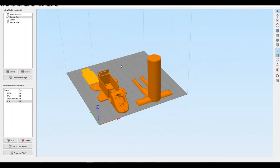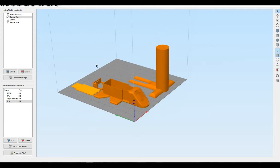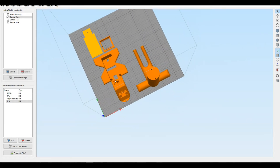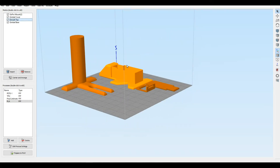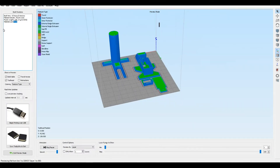In Simplify 3D, the first five millimeters are 100% infill so I have a solid base all the way across with no bending when there's weight on it. The base 2 is also 100% and then I go up to about 30% for the rest of it. I was able to tap these holes, and this is printed on the CR10 so I was able to fit every part on the bed.